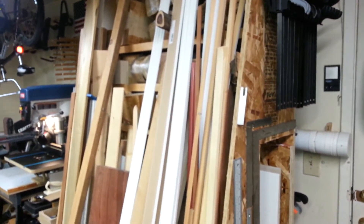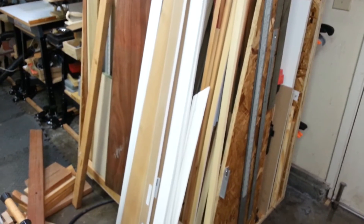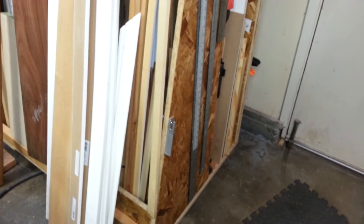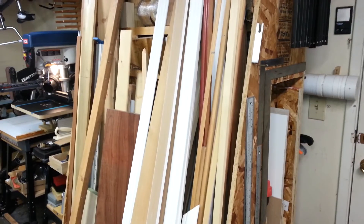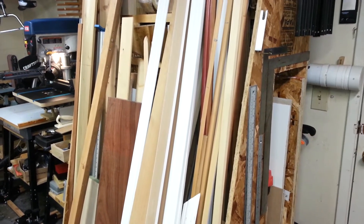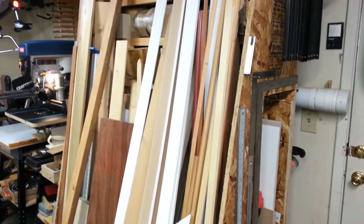One other feature of this mobile lumber cart is that it also doubles as a panel cutting rack. I know that's not wood turning related — that's more for the flat work. You'll see that there's these little aluminum brackets on the side that I made from some aluminum angle. I just ground in some slots. There's a lower bar and an upper bar that go across these, serving as the holder for sheet goods. Then you can use your all-in-one clamps as your edge guide to break down your sheet goods. I've used that a number of times and it just comes in really handy.